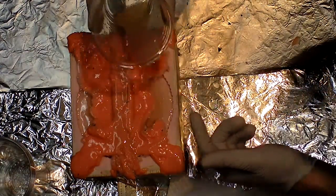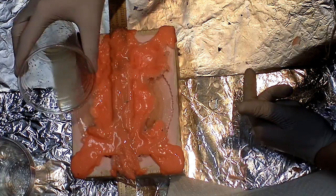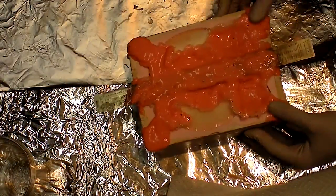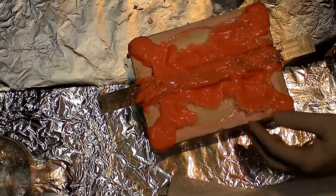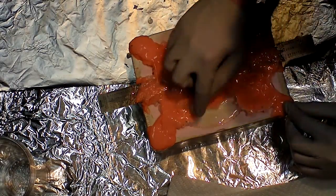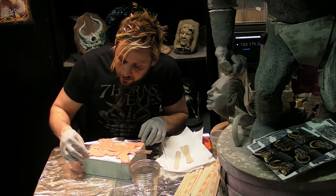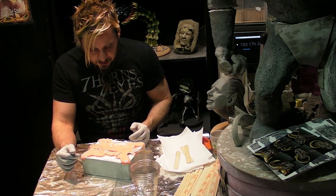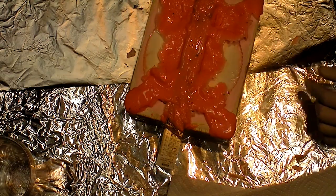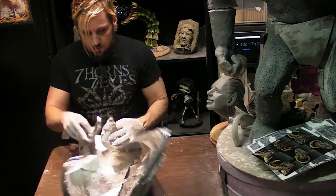You can see the beauty of this one-and-a-half part mold is that I can easily see how full it is and put just the right amount of resin in there. Looks like my table's not completely flat, because I've got more material down at the bottom than I do up at the top, so I'd need to do another pour to even it out — although since this is just a throwaway one, I probably won't. You can see it's only been about two, three minutes and it's already starting to turn white. It's heating up, very hot to the touch, so it needs just about another minute or two. While it's setting up, I'm going to clean up my workspace.